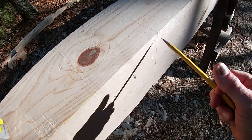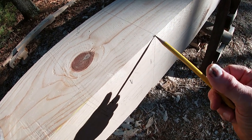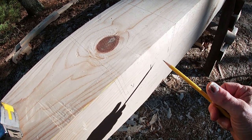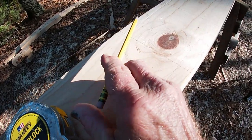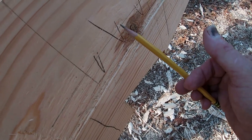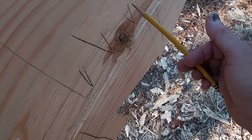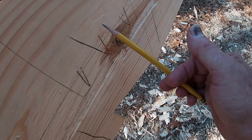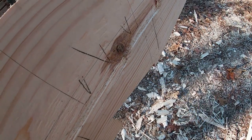I've got this laid out and ready to cut. I'll stay away from these lines just a little bit with my saw and make a series of cuts down to the line on the inside. Then I'll go around to the outside, hold my saw at an angle approximately the angle of the cut, go down close to the line, keep my saw at an angle so I don't mess up, then knock those pieces out and come back and clean it up.